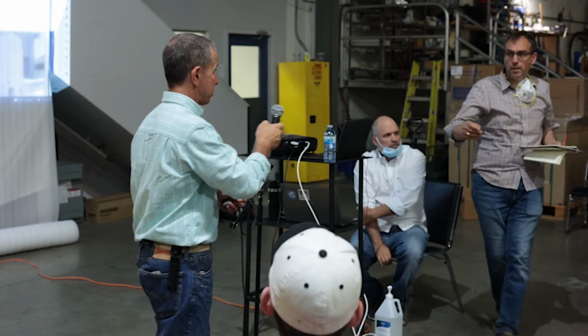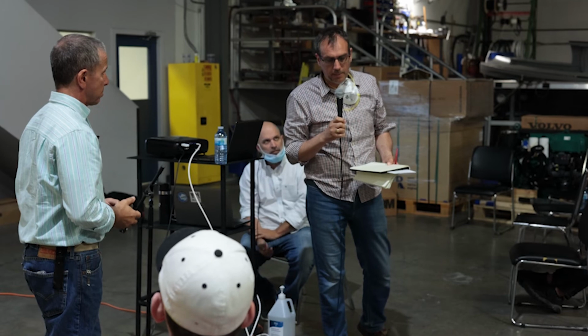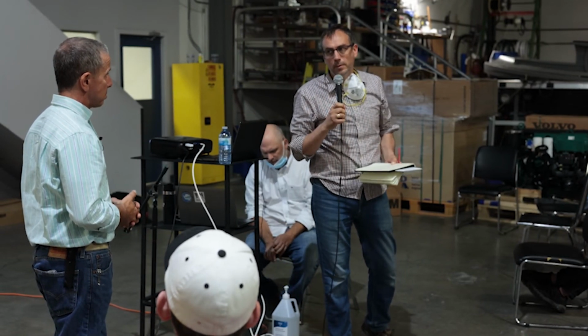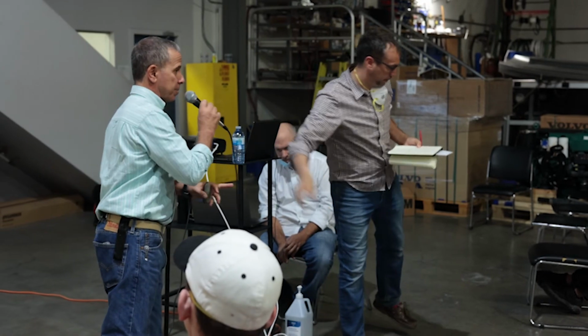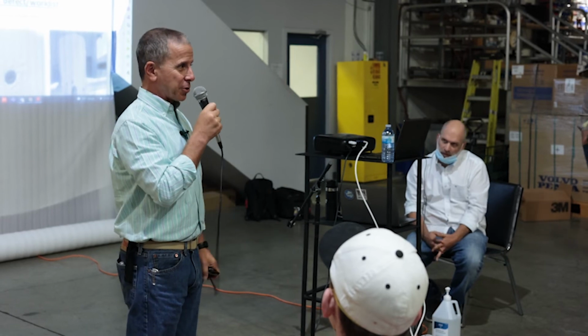All right. Just a quick one, if you can maybe briefly explain when we paint aluminum, as we discussed last time, how important the primer is versus the actual paint. Yeah, so when it comes to painting aluminum, again, an etching primer, because aluminum, I keep saying this, doesn't like to be painted. It doesn't get along with paint very well because it oxidizes so rapidly, and any exposure to air creates that oxidation, which is incompatible with paint.